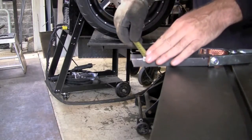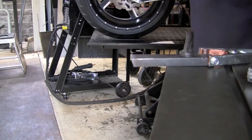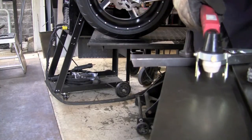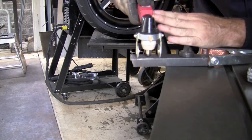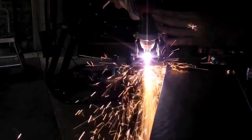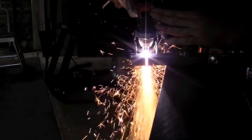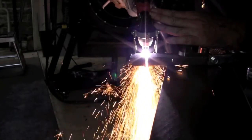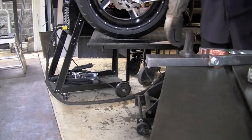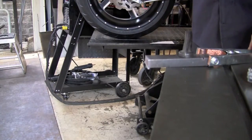Here we are with a piece of one and a half by three quarters cold rolled steel. I have my wheeled standoff set up on my torch — I'm 220 thousandths off the deck. I'm running 100 psi and 80 amps. You can see we have very good cut quality, very little curve. And I cannot wait to get this machine hooked up to the CNC table — I think it's going to be a blast.